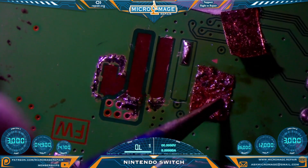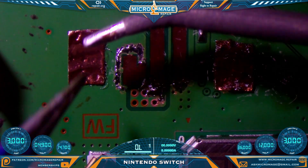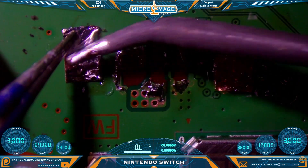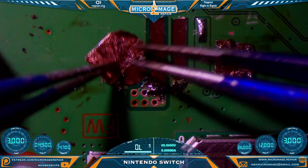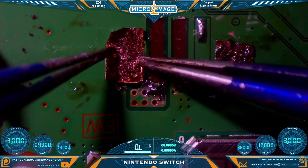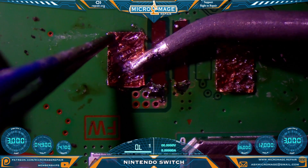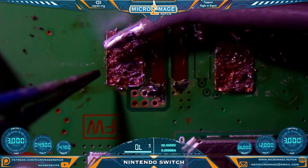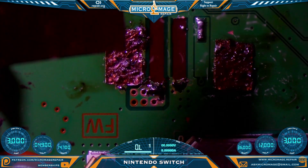That should be very secure. We'll do the same thing for pad number two over here — solder on our tip, pre-tin everything, get them where we want them. We will make sure we do not accidentally make contact with this trace over here; we don't even want an accidental bridge or anything like that. Much less contact point over here, so let's make sure it's thoroughly down — nice and solid. Now we need a couple more strips.